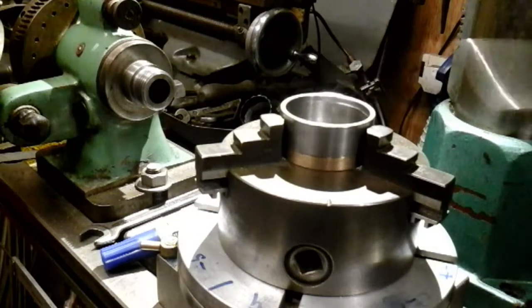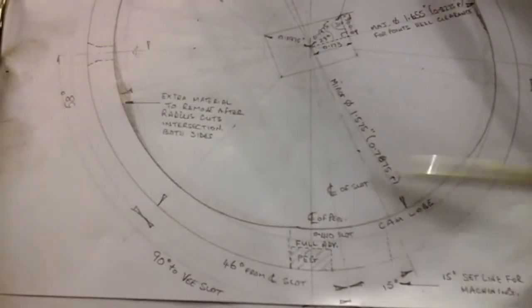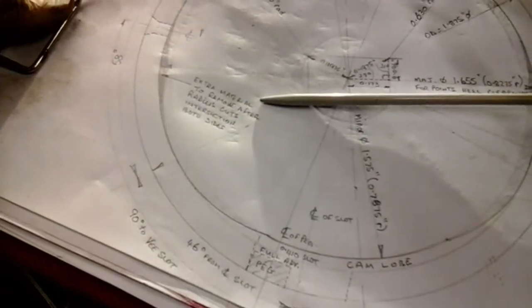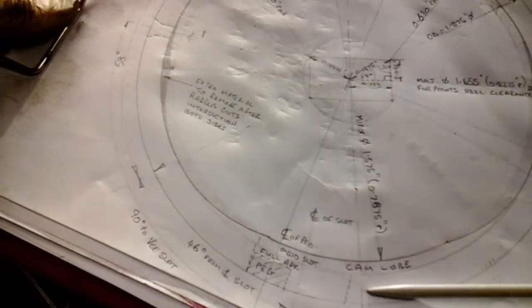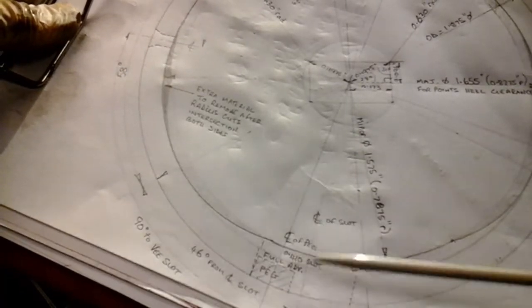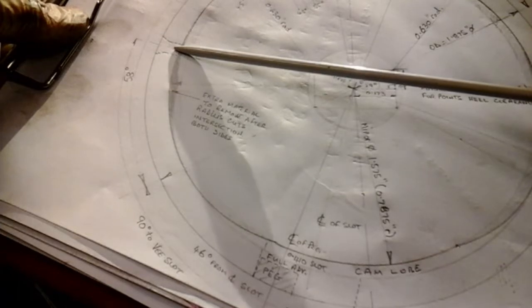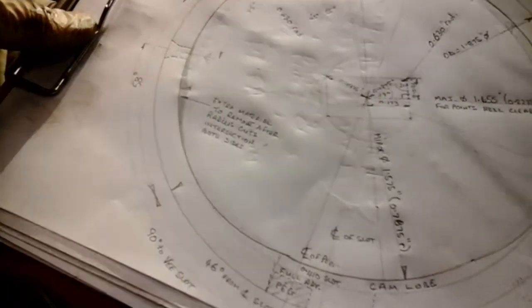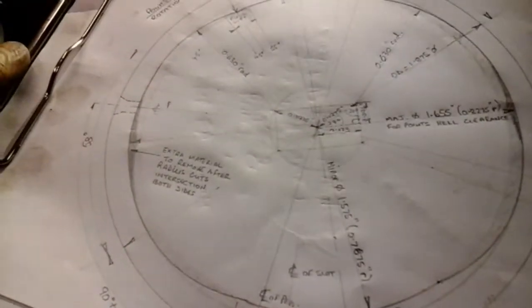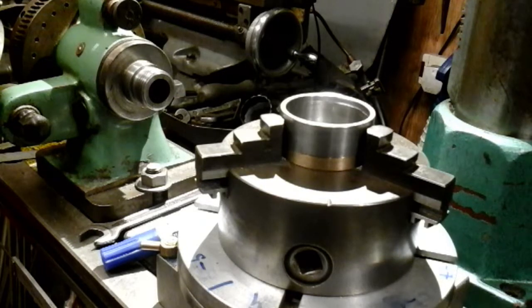It's still in the machine actually. What I've got to do now — let me just get the drawing back — I've got to offset it on the rotary table. I'm in that position at the moment, looking square on. This is the centre line of my machining. I've got to offset the cam 15 degrees so I can put a slot mill down this to get the advance and retard slot. Once I've got that, while it's in that position I'll scribe a line across at 90 degrees. I'm going to put a 3/8 cutter in. It's a 400 thou slot but I've only got a 3/8 cutter, so I'm going to go in with a 3/8 cutter and move over 12 and a half thou each side.